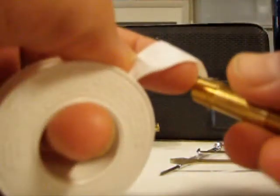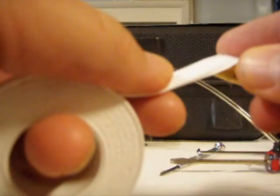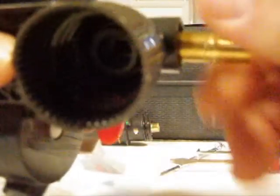For the Teflon tape technique I use: start on the top, hold it in place, and then just rotate the threads to the right. As you rotate the threads — with the end of the tape facing towards the camera — as you rotate in, it won't bind up. Go ahead and get that started.